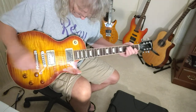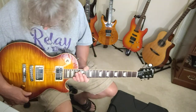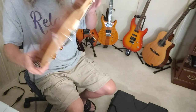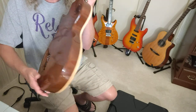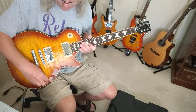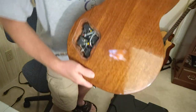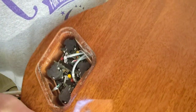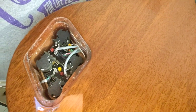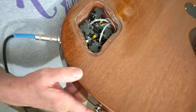So that's what it's going to be if you guys ever experience this problem. If you try to spray in here, try that first. But chances are, if it's going to activate as a coil tap, then the problem is going to be in the switch — whether you've got to spray it, or look at all these wires here. It looks like I've got a couple of resistors in there, or maybe a couple of mini capacitors there. If they've got microfarads, those would be capacitors.